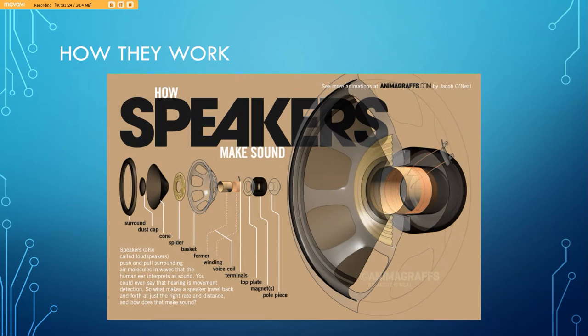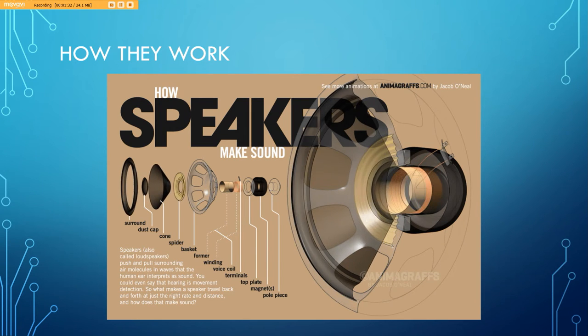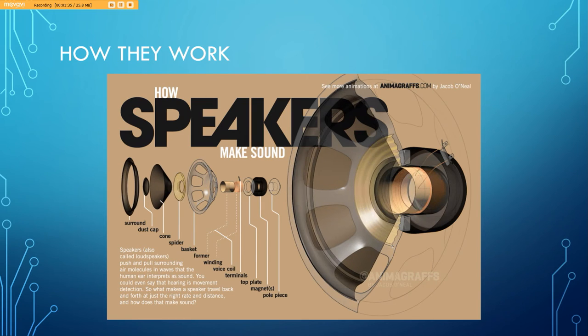Here's just an animation of a speaker moving with all the components. It's kind of interesting to see how everything moves. You'll also note that the basket, permanent magnet, and some of the plate pieces are the only ones stationary, while the rest of the components, which is the cone, surround, spider, voice coil, and all that other stuff, is moving to produce sound.